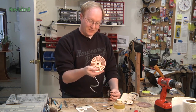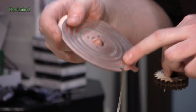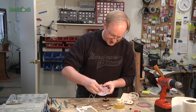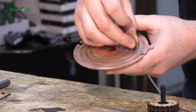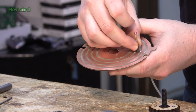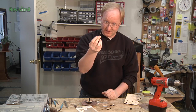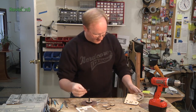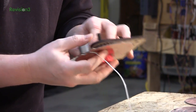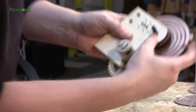Here is our copper clad disc. I've attached the wires to the edges here, and the reason I did it like that was so there's enough room for the brushes to move around so they don't hit where the wires are — that's why there's a good decent gap between them. These are some carbon brushes that I bought. This is going to bolt in here, which we showed earlier, and if you look through these holes you can see how it lines up to the copper tracks we made.